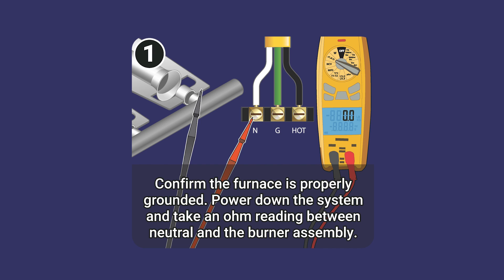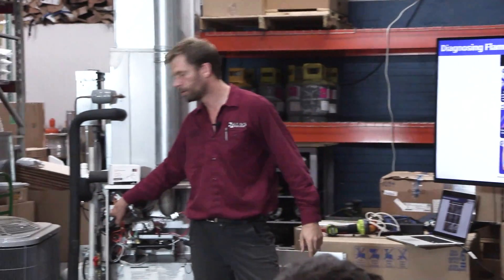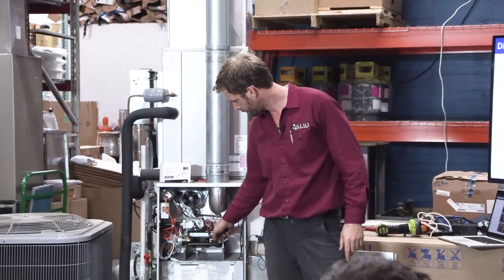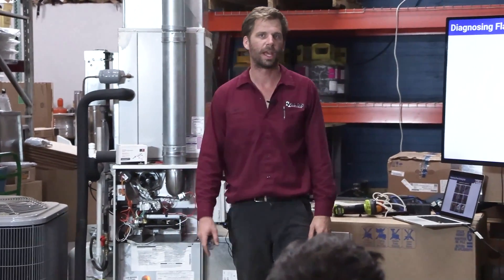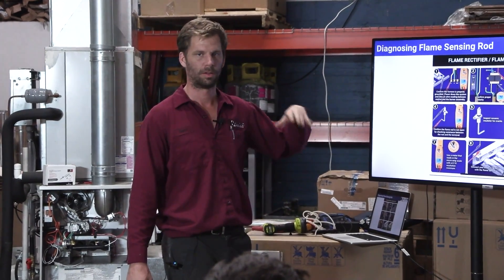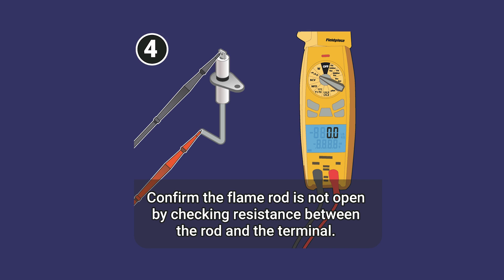You can check between ground and your neutral leg coming in — the first connection point from power, neutral, ground, right here. Do we actually have a good connection? If my unit is grounded, move on to other diagnostic areas. Is my board actually sending the current? You can test that with micro amps testing.